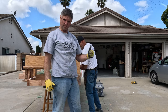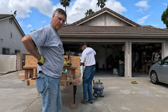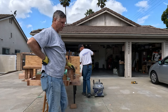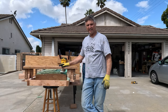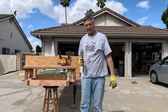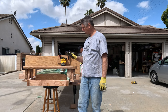Good news is it's working out pretty well. So far, so good. Sort of getting into a groove here. Brian's vacuuming while I readjust this and we do a stripe. Now, one thing we've already decided is we tried to cut right through the red cedar blocks, but it just doesn't want to go through there that easily. So we're just skipping those, and I'll grind those down by hand with the sander to the right shape. We're just going to do the foam with this.